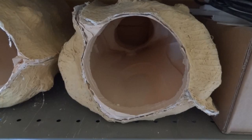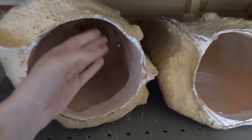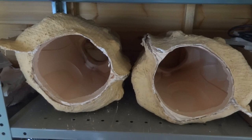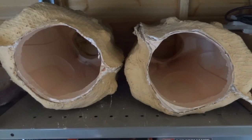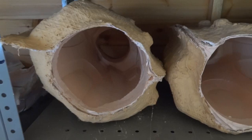But for fiberglassing, we need to lay up the fabric. So it's going to be quite a challenge. Although the top of the thigh, the hole is quite big and I can get my hand in, it's going to be a challenge to lay up fiberglass in there. So the plan is going to be to rotocast in the top coat, which is basically the gel coat, or the first coat you put in, which makes the outside layer of the finished piece. So that's fairly much liquid. We can just pour that in and rotate it around. So I'm going to get a nice thick gel coat on them, probably 3 to 4 coats.